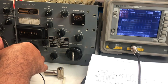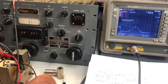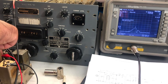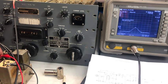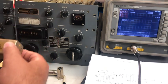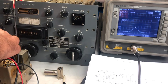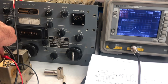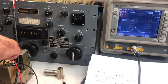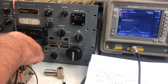At the moment on eight kilocycle my connection is very poor here — I should prepare something more stable. I'm losing now five dB. If I slide in, I'm actually not losing so much — five dB — and if I remove, I'm losing even more. So I wonder if there is something wrong with the shield. Let's see if I can find something.